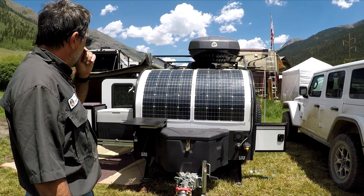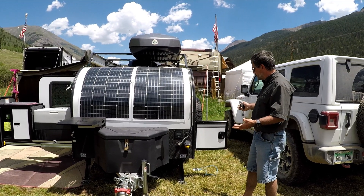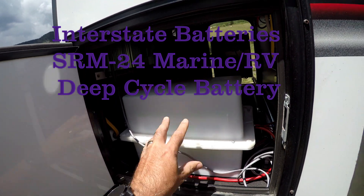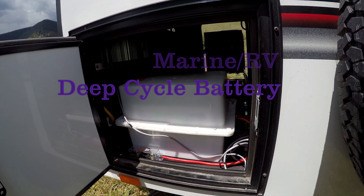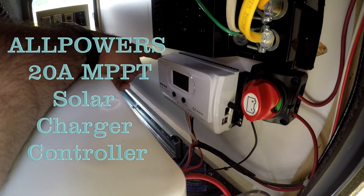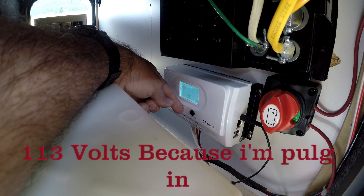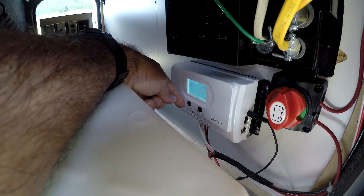What I've done is put the panels in series to get the maximum output, and then I connect it to the battery pack. I installed the MPPT module right here. As of right now I'm getting 113 volts and I'm not even seeing 21 watts.